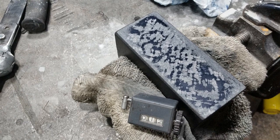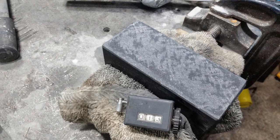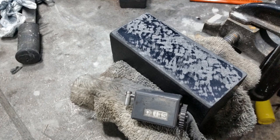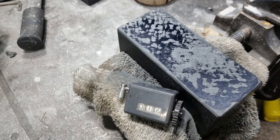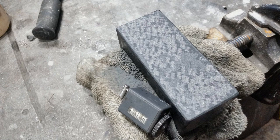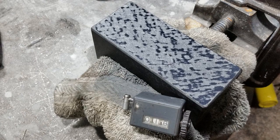Things are really starting to come in. You can see a bunch of measurements along the one side where I'm doing all this with the bluing, and I'm also running it against the dial to make sure that it's parallel to the other face I had done. We're working on scraping here and trying to get rid of this big hole in the middle. It's going to take a few more rounds. I'm mostly bump scraping this manually with a scraper — I don't think I sharpened my tool during this whole side, whereas with the power scraper I would have done it after every pass. Most of that gap has been worked out, also passing over it with a lap to flatten it out.